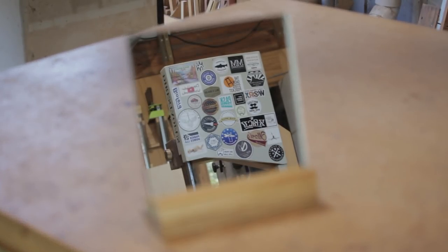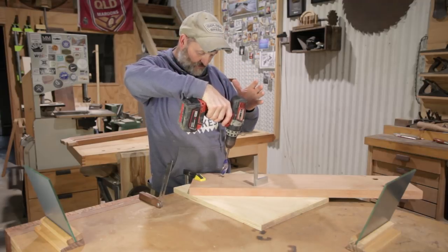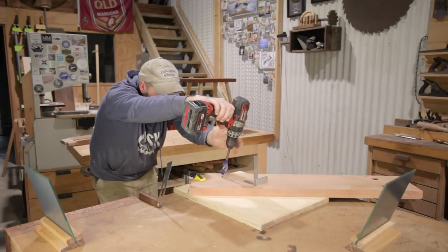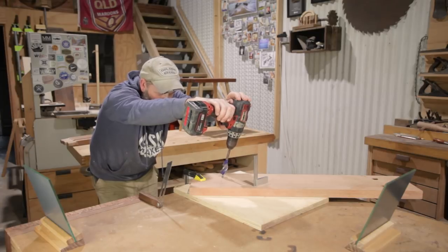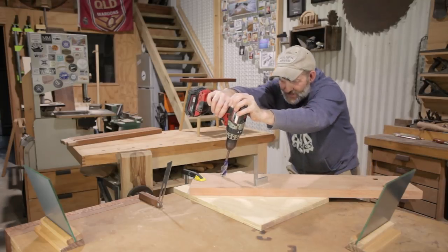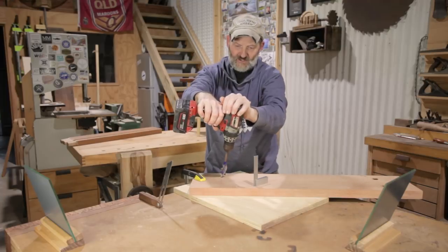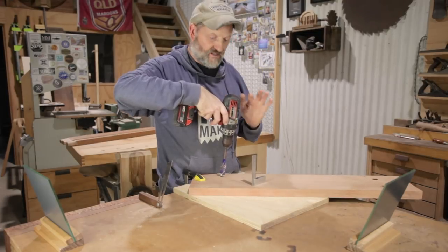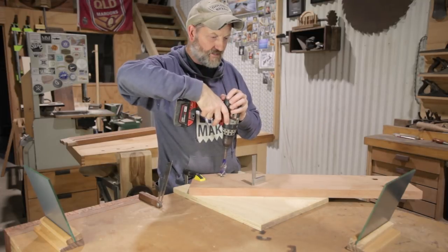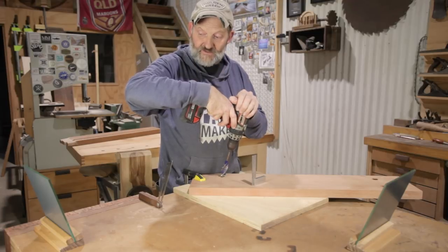To drill the leg holes I'm going to do something I've seen before but never tried — using two mirrors to help keep the drill bit in the correct position while drilling. In the past I would have a square set behind, and looking along the sight line I'd use the edge of the drill bit against that square to keep it upright, then come round with my bevel gauge set at the correct angle as a guide. But you have a tendency as you move around to move the drill bit just a little bit. With the mirrors I can still see the square and the drill bit without moving my body, and make adjustments by looking in the mirror to set the angle.